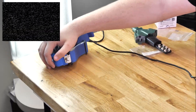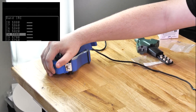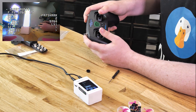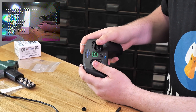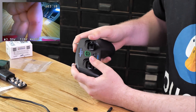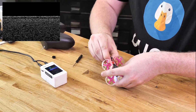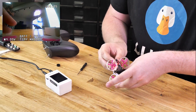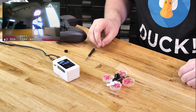Once you confirm, the screen's going to disappear. Take your goggles and tune into Fat Shark 2 — my goggle shows it as iBand. Then to get out of this menu, go down to Back, all the way down to Save and Exit, and that'll save it. Now if you change batteries and plug back in, it'll boot back up to channel 2.